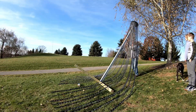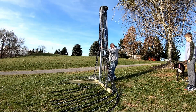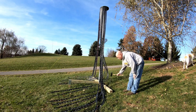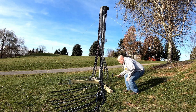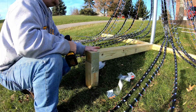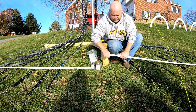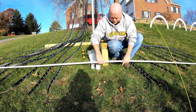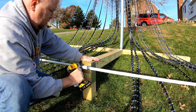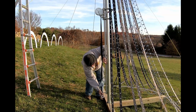This is not a complicated operation — yes, it's heavy, but all the weight is sitting on the ground. If you walk it up like an extension ladder it's a pretty easy one-man job. After reattaching the front guy rope, I drove some rebar down through the holes in the ends of the base — this guarantees the legs won't slide down the hill and gives a little protection against tipping. The custom-length front foot goes on with some strapping plates. I made my base ring out of PVC — conduit would have been better, but I didn't have a good way to bend it.